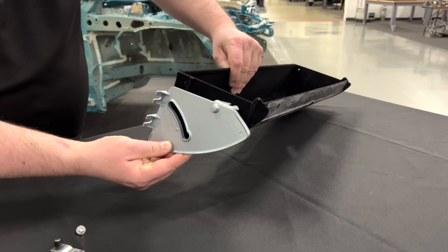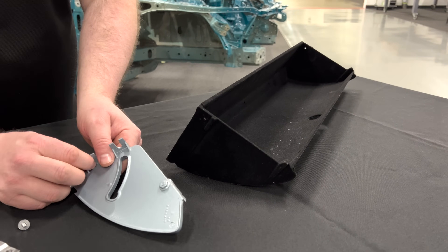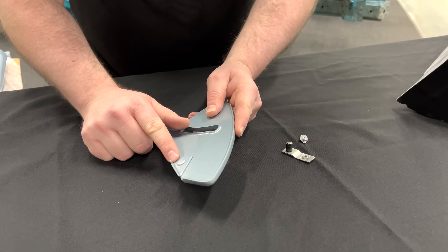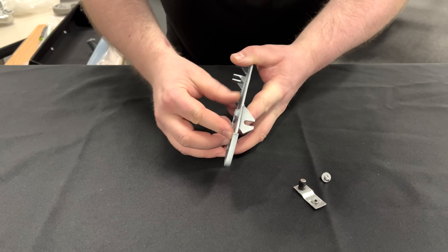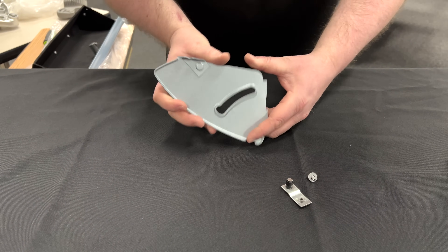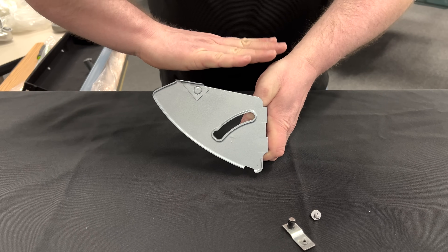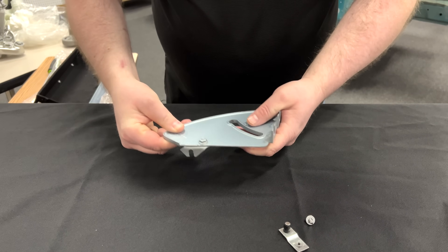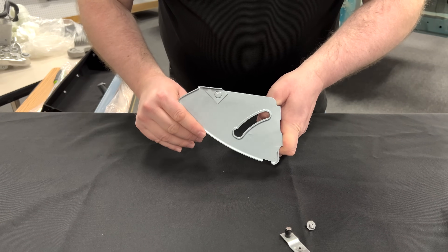But we have a problem. You'll notice that in vehicle, this pin does not align with Jerry's casting. Also, Jerry has this metal tab — it's made from bent steel, with a stud that is welded to that steel. It is then put to the bracket and a bolt is tightened down. Jerry wants some sort of tolerance: when he bolts this to his cross-car beam and the top pad comes in a little crooked, he wants fine-tuned adjustment at that top surface so by having that on a bolt he can loosen up and change the angle to get a perfect match.